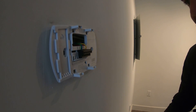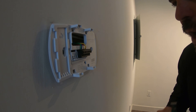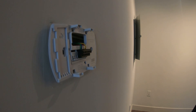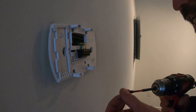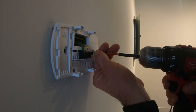Make sure all your wires are tight. We've got green for fan, blue for the changeover valve, yellow for the compressor, and red for the power coming in. You want to keep this jumper in here. The only time to remove this jumper is if your system uses two transformers for heat and cool, which is very rare in most residential applications.